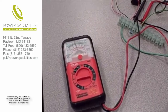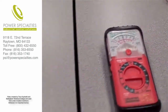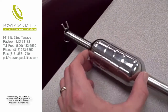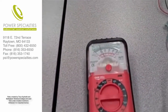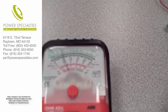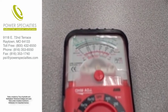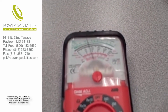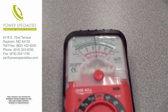What I'm going to do here is show you how that voltage goes up and down representing current going up and down as the float is moved. I'm going to take the float and move it down towards the end, representing low level. We come over here to the meter and we see the position of the needle, which is a little over 1 volt. As I move the float up, you can see the needle jumps. Move it up again, the needle jumps again, and so on.